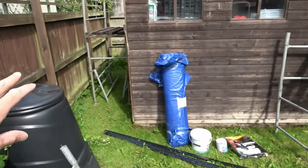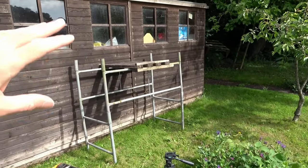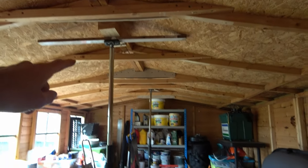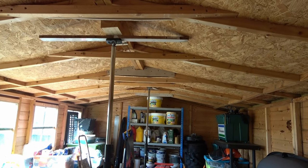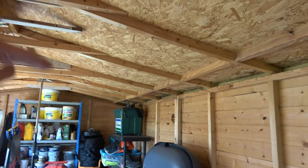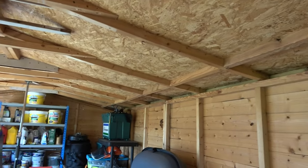I've got some sections of scaffolding set up because with a larger shed roof it makes it easier to get up on top. Because walking on my shed roof is unavoidable I've placed plasterboard props in two positions under the roof to give it some temporary support while I'm working on it. I've also previously strengthened this roof because it's not a structural roof - too much weight and it would push the sides of the shed out.